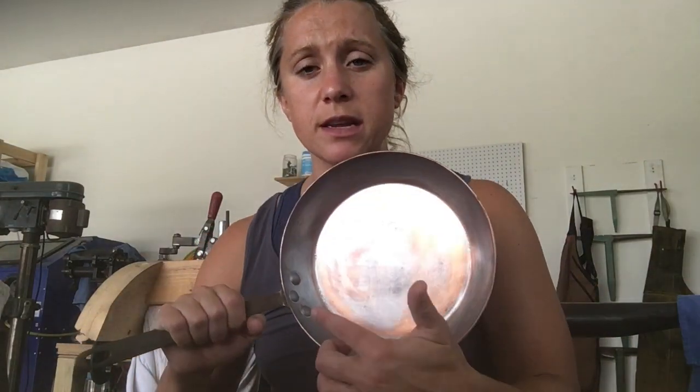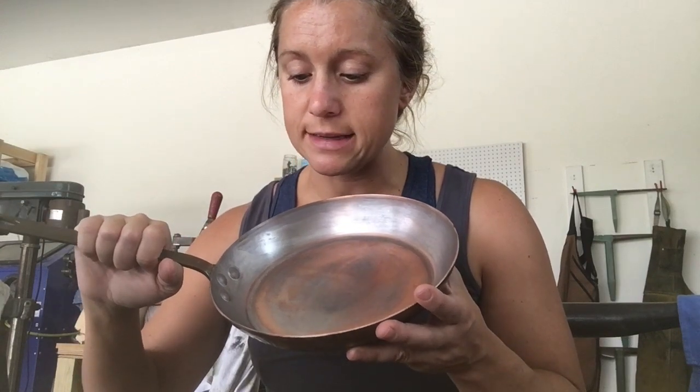There's always a lot of elbow grease involved, and around the rivets that's really hard to get clean enough so it takes a new tin. So this is a piece — you can see some of it, it's always hard because it's so shiny — but see how all the oxidation from the tin that was on there is gone. This will actually take new tin because the tin has been completely cleaned and de-oxidized. Even though there's quite a bit of tin in this particular skillet, I can essentially reuse it — when I flux this up over the fire, the tin will become liquid again and take the new tin I put in, all working together.